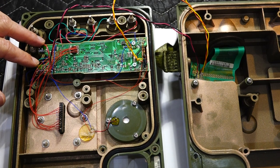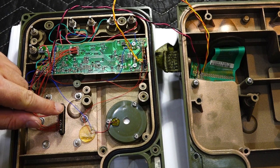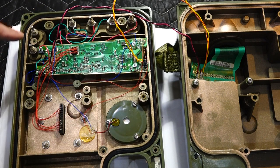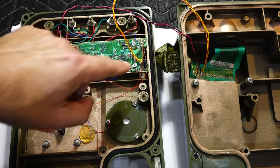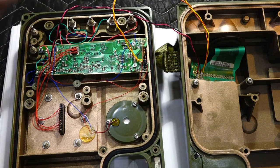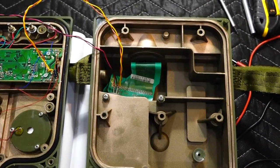The inputs have been brought in parallel to the two terminals. The keyboard's eight cable inputs go to the keyboard. The ringer goes to the plus and minus of the original ringer, except they go through the ringer volume button and switch beforehand. Also in parallel with the ringer, I have a 1K resistor going to the ring LED. The mic and the speaker go to the connector down there.